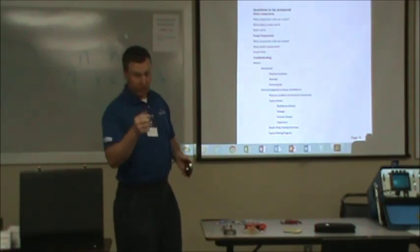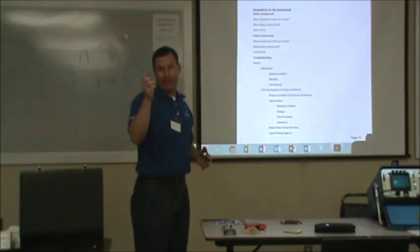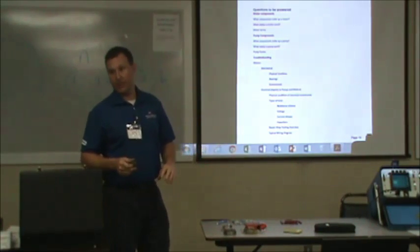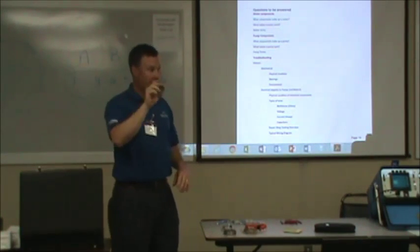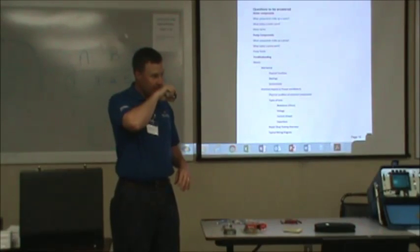And the vertical motors that you just asked about, you'll see two of these hanging up there. Why they don't use one, I don't know, but they use two of these. Some manufacturers, some engineers design, I guess. But anyway, you'll see a lot of these in the lower end of pumps, double row angular contacts. Ours, like your motor bearings, we talked about grease a little bit ago.